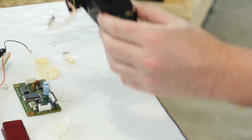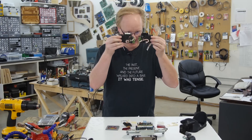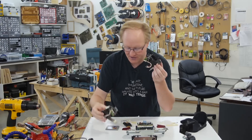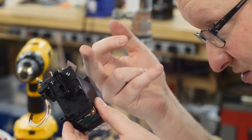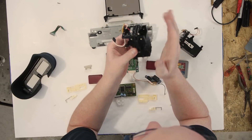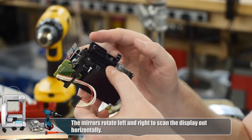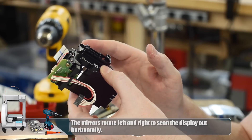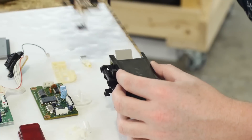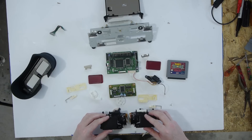I think we should start going from the eyes out. We have our two screens — for lack of a better term — and I think we should have a fixed diopter so everyone will have the same diopter. If we do a fixed diopter like this and have one frame, we can get it actually a little bit closer to the eyes. Just so long as the vibrating mirrors do not occlude into the front surface. What I could do is make a couple of layers — one layer of acrylic here to give about 0.1 inch distance, and then attach another layer of acrylic over both pieces to tie them together.